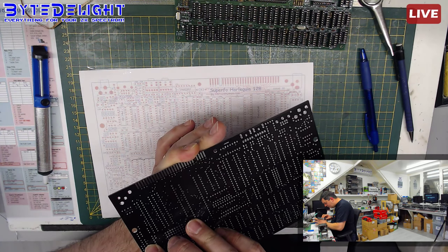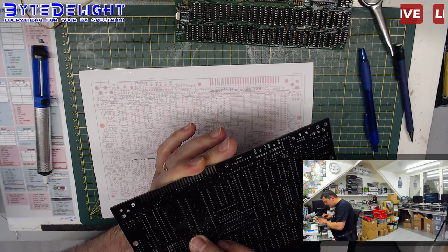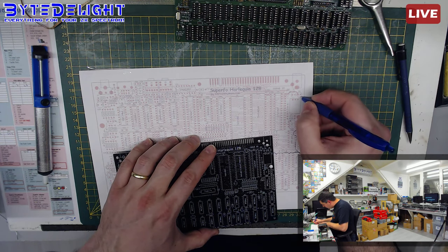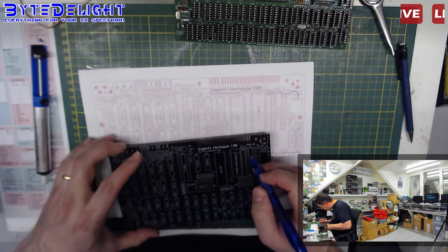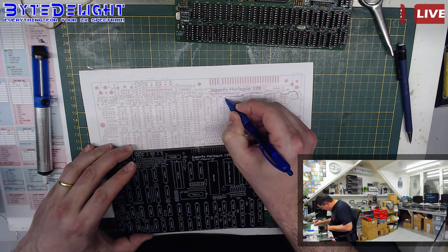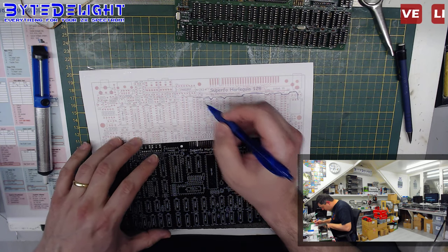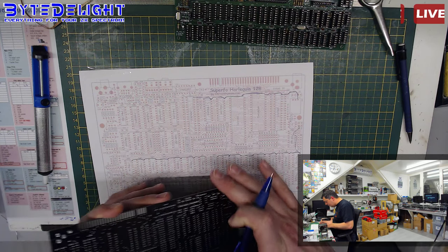I'm checking if I can find which track goes to 5 volts on the input of the board, and I haven't found it yet. What I also can see is that when it's converted from 9 to 5 volts, it's going to this line here. It's quite easy to see, and it's the same on the board. I already saw it. So we go to this pin here, and up there, to the capacitor, and then to the chip. So there should be some line going down here to the other nets on the board, and of course to these parts as well.